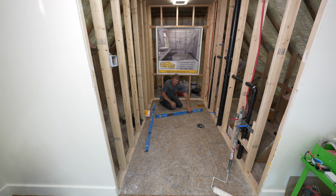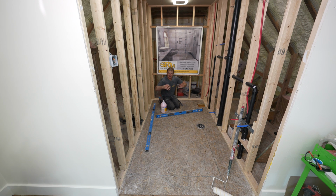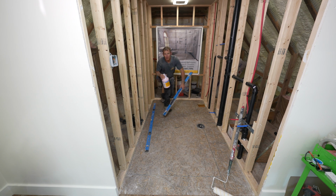It looks like we're most likely going to have a good 3/8 of an inch of leveler on this side of the room. So we're going to go ahead and prime this surface before we even prep for the leveler. Meaning I'm going to put some indications everywhere to get an idea of what is level so that we know what we have to move our floor leveler to. But what we're going to be using is a primer for the Ardex liquid backer board.